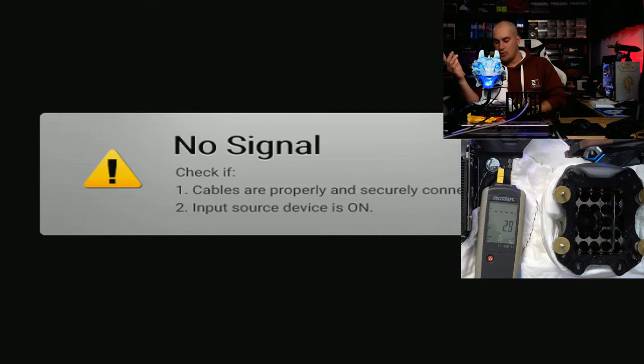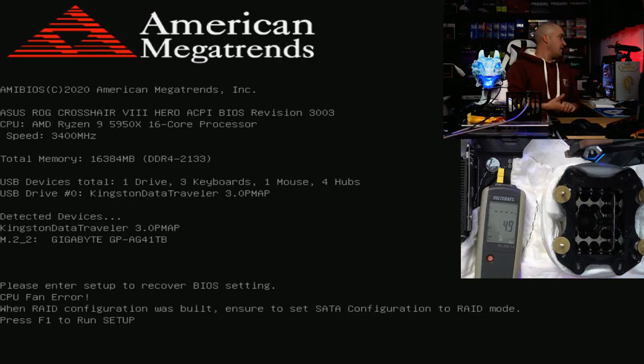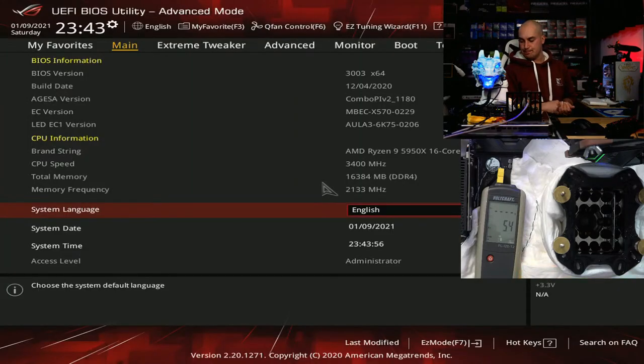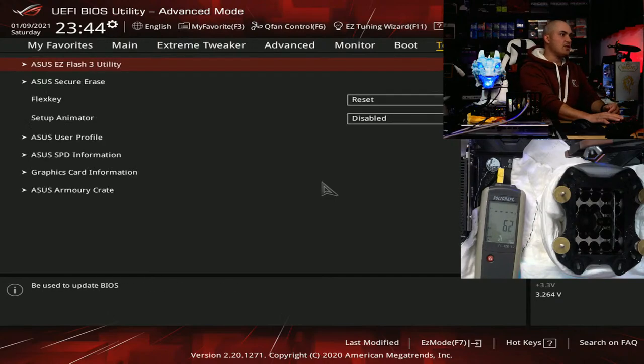Okay, everything is booting again. Yes, we have to go above zero to get the motherboard started again. Oof, I hate that. Since now, as you can see, we have water all around the place. No, but I hate Vaseline. Vaseline is useless. I have senior diapers. This is the key. Vaseline is a mess, and after some time, the board is like it's doing bad. Since you have to clean it with like an ultrasonic cleaner, it's a mess. I do with the diapers, and I don't have any issue at all. I can bench for like 5 hours, 6 hours without any condensation at all.